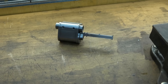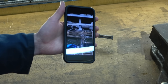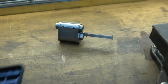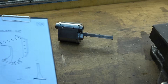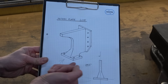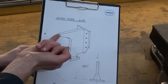Various designs on the 5-inch model exist, everything from a rather simple version Martin Evans did right through to an as-close-as-possible replica. I've given it some thought and come up with what I'm going to call Mr Crispin's interpretation of a motion plate — which is the technical term for this bit — and that's what it looks like. It's going to support the top of the slide bar, mount to the chassis, and support the running board.